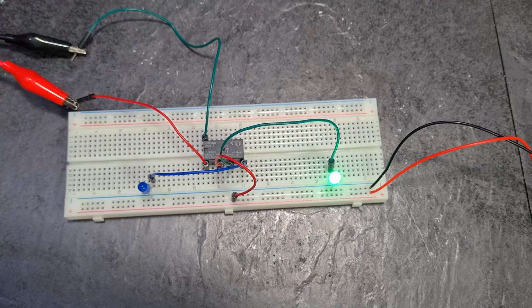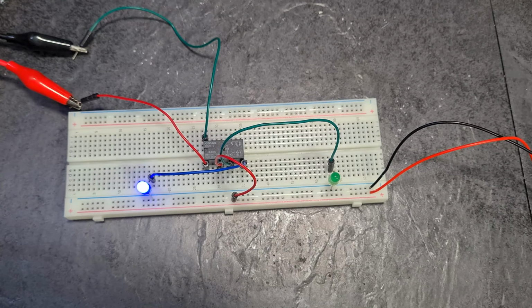So I'm increasing the voltage now. We're at 2.2 volts, hasn't triggered yet. 2.5, boom, there you go. And then if I keep going up higher, so 8.3 volts there, no difference. Cool. So currently triggered at 2.5 volts. So let's turn that back off, back to 0.